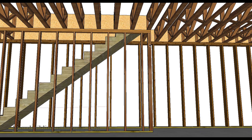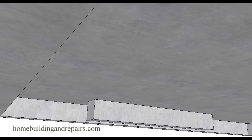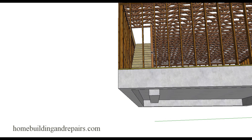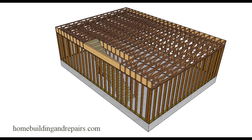You might even need a doubler underneath the truss to take some of the weight off of it. Here's another section view showing the footing that would be underneath the wall — remember, load-bearing walls require a footing, so if you're building a building like this you're going to need something like that. Again, this is something that the architect or the engineer will provide you with.